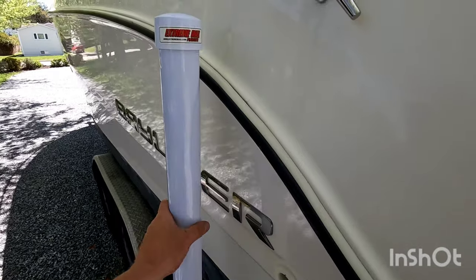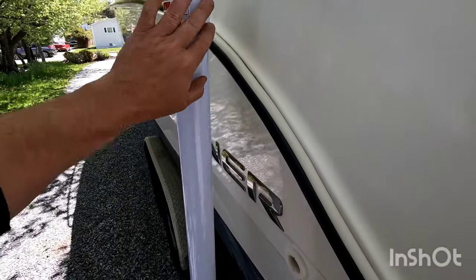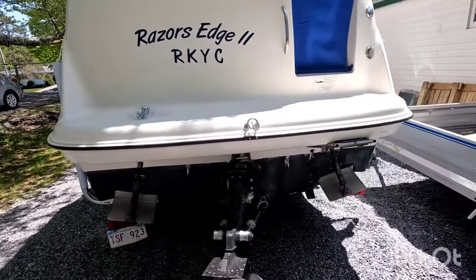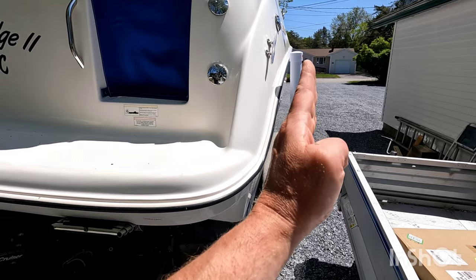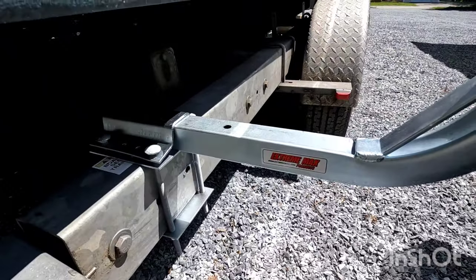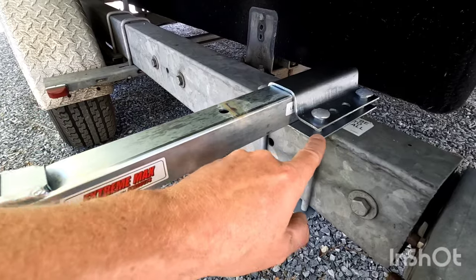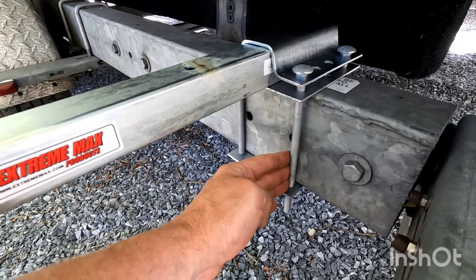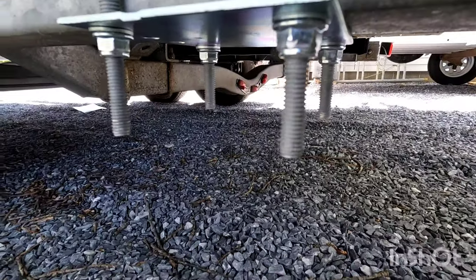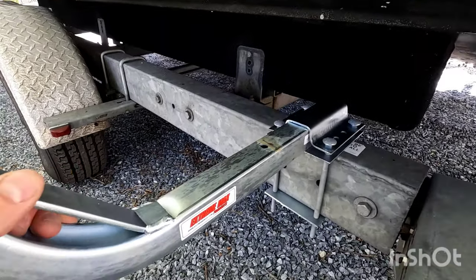There we go. These guide toppers aren't held on — they're just dropped on the post. They do spin, and they are hard plastic, so just remember that against your boat. Leave a little bit of space. We've got this side done also. You can see there's a little more space on this side because the boat should actually be over this way a couple inches. You've got your top bracket, your plate, and a lower plate. Check to make sure your bolts are long enough — I have a nylon lock washer and a washer on the bottom. Every year, make sure you snug these up to keep them nice and tight.